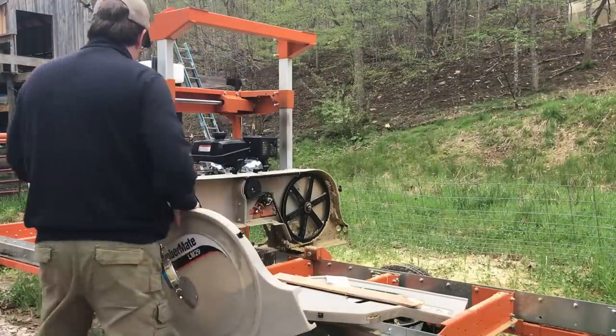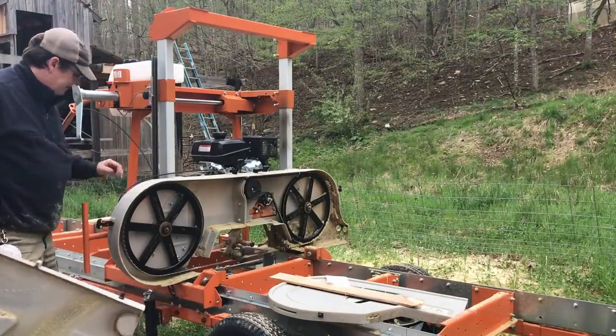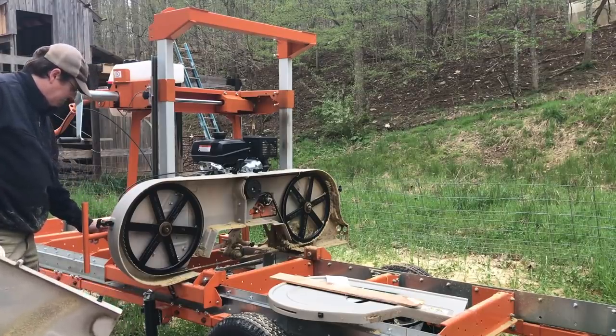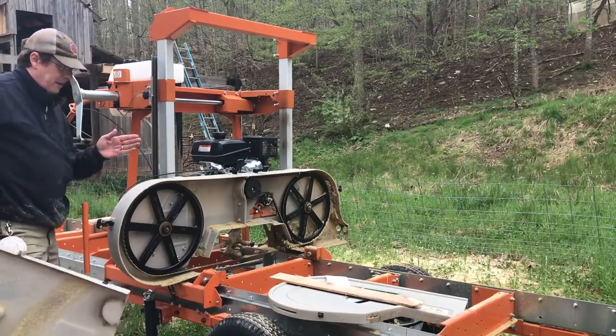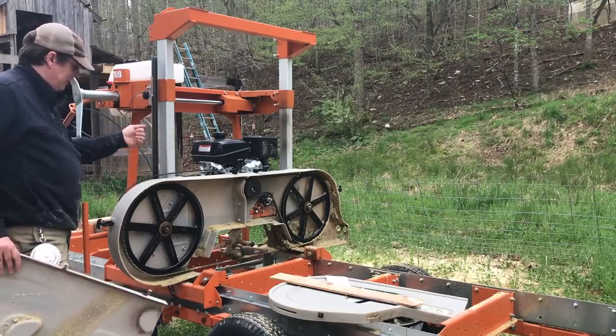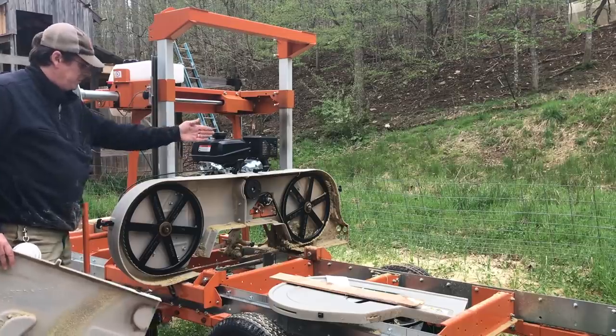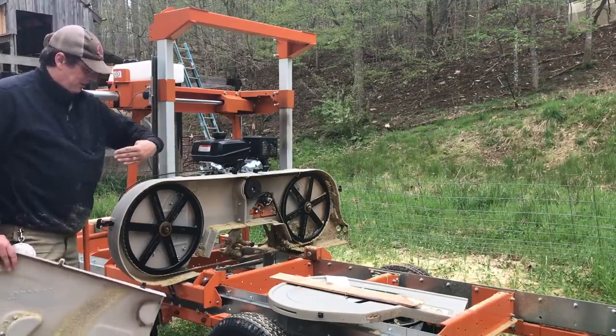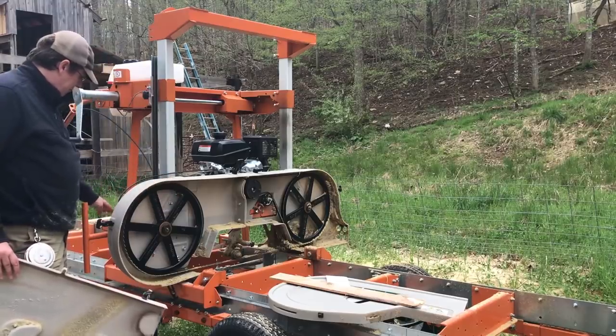One of the cons, I would say, in their engineering, these axles are aligned by, there's a small bolt in here that you turn, and it pushes that rear of that axle either, you know, this way or allows it to come this way because there's resistance on it. So it pushes it in or allows it to come out. And of course that affects the angle on that wheel. So those adjustments were made.